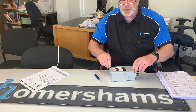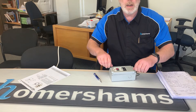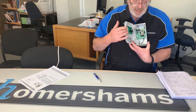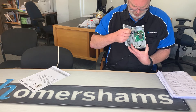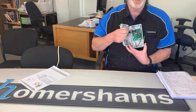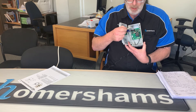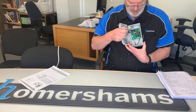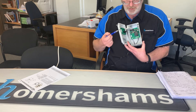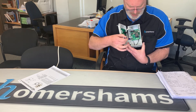It has a number of good security features. One can lock out the set point adjustment or any of the parameter adjustments. But there is also the ability to hardware-lock any changes using this jumper here. When set in the current position you can make changes to parameters; when it's shorted across those pins you cannot make changes. So it's an extra safety feature.